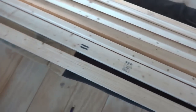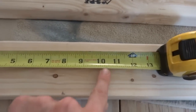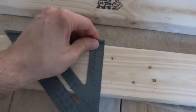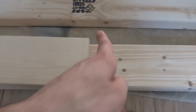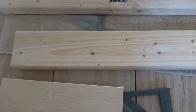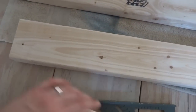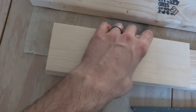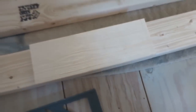When you measure them out to cut them, first you can just measure 10½ inches, make your tick marks, take a straight edge, draw your line, and cut it. Then take the piece you cut, line it up to the edge, make a mark, and cut the next one. If you know how to set up a jig for your saw, you could set something up 10½ inches away from the blade so when you slide your board up against it, it stops and you just chop. I'm probably just going to use the first method — line up the piece you cut, mark a line, chop it, repeat.